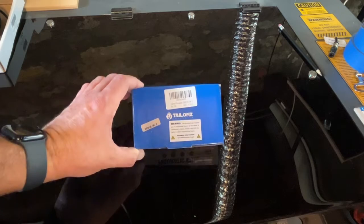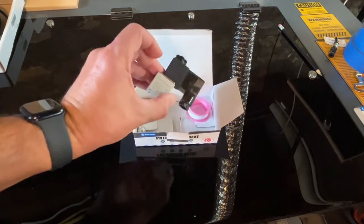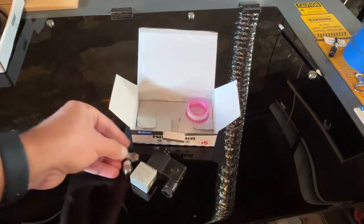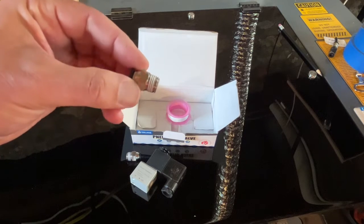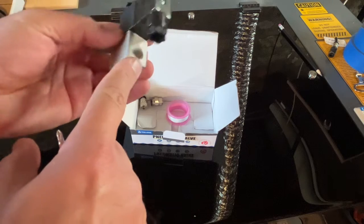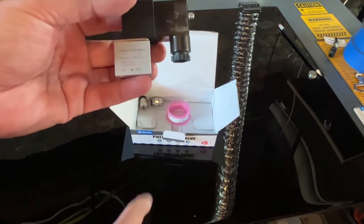Let's go over the main piece of equipment for this install — the pneumatic valve. What we have in the box is the valve itself, two quarter-inch by six millimeter tube quick fittings, and a little bit of Teflon tape. These do have a little bit of sealer on them already, but I'm going to put Teflon tape on there to make sure we get a good airtight seal. On the valve itself you'll see the air connections where you thread in those six millimeter tube adapters — in from your compressor, out to your laser air assist head.